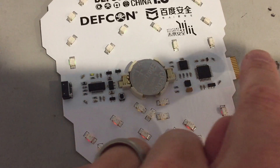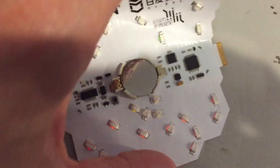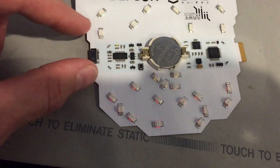The main circuitry is right along the center area. The board is relatively flexible, but I did put an additional copper pour right in the center to give it a little more stability and rigidity, just so the components aren't going to pop off so easily.